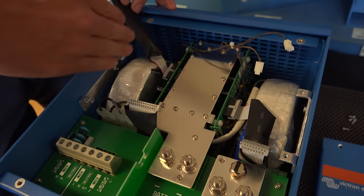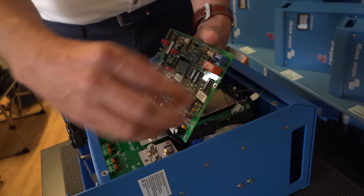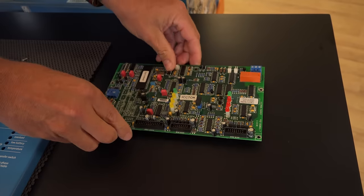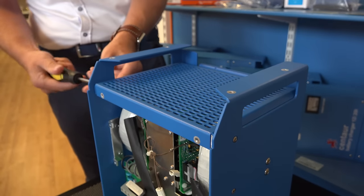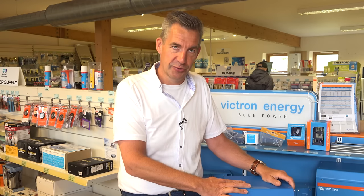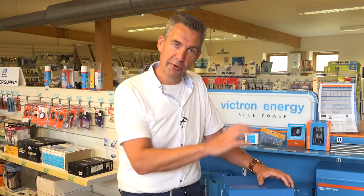Once the click happens and input power is joined to the inverter output, the inverter starts acting in a new role. The voltage of the inverter is controlled to a lower level. With two voltage sources running in parallel, energy flows to the power source with the lowest voltage — in this case the inverter — because the inverter tries to get its voltage lower. It cannot lower the grid voltage, but it gets a lower potential, so energy flows from the grid towards the inverter and into your batteries. That's how you charge the batteries. The charging current is controlled by regulating the inverter voltage — the lower the inverter voltage, the more charge current flows toward your battery.